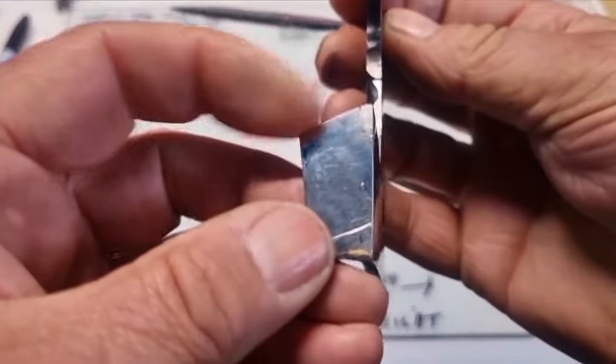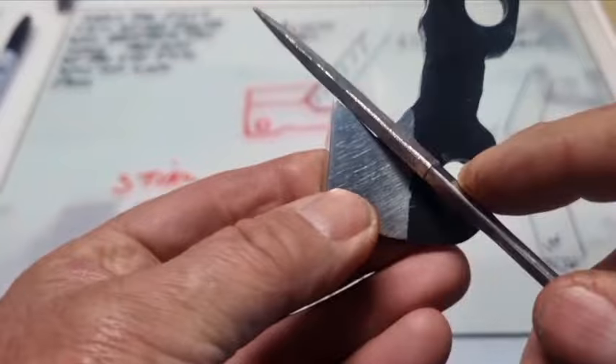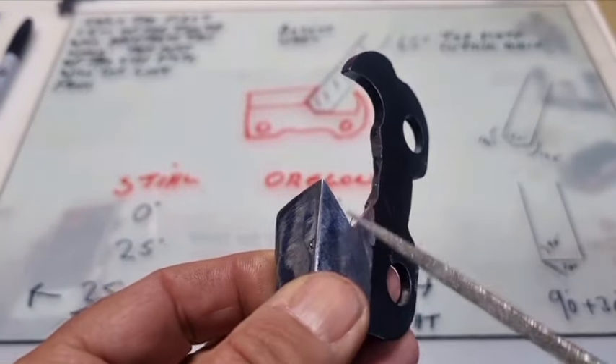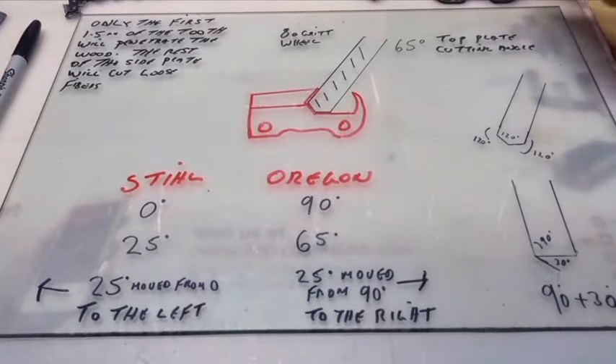When you look at the top plate of the Hexa at 25 degrees, the 65 degrees here is really 25 degrees on a Stihl. When you look at it from this angle it looks like a spear, and that's why it works so well — it penetrates the timber. Due to the rotational forces, it pulls the tooth back out and the tooth becomes straight again until it digs into the next bit of timber. Left and right teeth do the same thing: digging in, going straight, lifting the chip out. A chainsaw chain doesn't cut in the true sense — it removes chips left and right, and that makes a groove, which we can call the cutting motion.